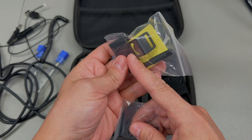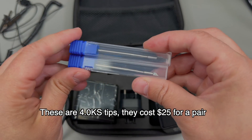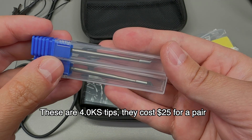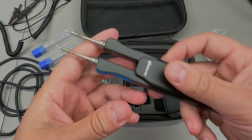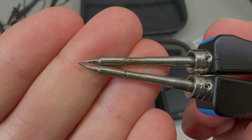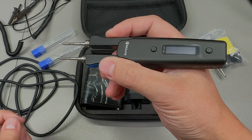There's the other part of the stand, plus a sponge. I also asked them to include extra soldering tips — these are the knife type — because the default included ones are a little thin. They work great for very small components like 0402 or 0603, but the wider knife-style tips help deliver more energy into larger components or pads.